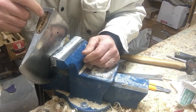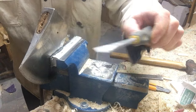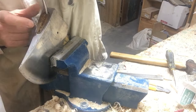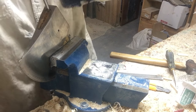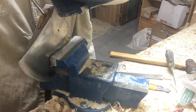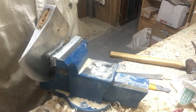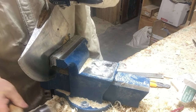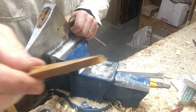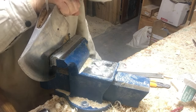That hole goes down in there and gets narrower at the bottom, so as long as you're as wide as the wedge up top, you'll get the wood at the bottom. Then all you need is this tool or a flat screwdriver. You put it in there, bend that wedge out — I'll use my screwdriver, just pound it in — and you can see it bends the wedge a little and pops it right out. Once you get one piece out, go down through the axe eye and it'll pop the rest of them out.